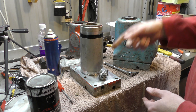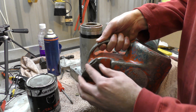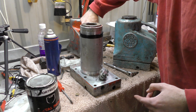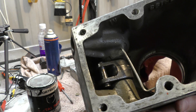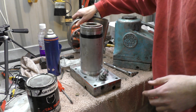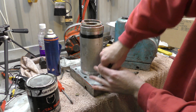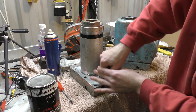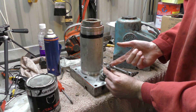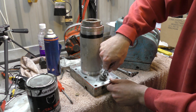The red one here didn't work. The jacking handle goes in here and you pump it up — it clicked back and forwards. What it was doing was: this part inside, which goes up and down like that, it goes round the plunger here and pulls it up and down. It was locked in there solid, but it was just pinging back and forwards over that and not pulling the plunger up and down.